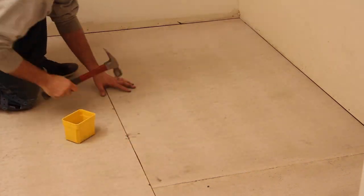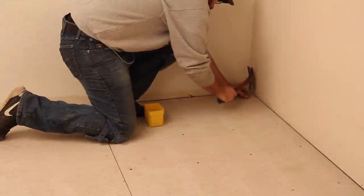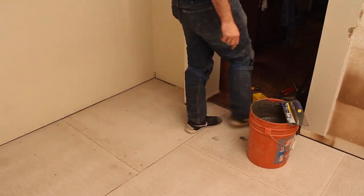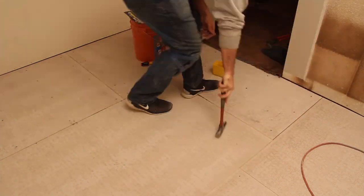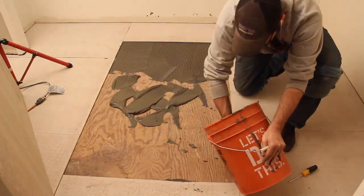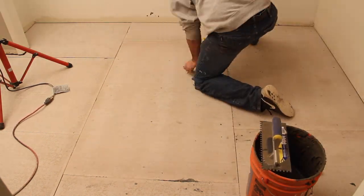To lock them in place, I used inch-and-a-quarter galvanized roofing nails and drove them in roughly every 12 inches. I continued the same process for the rest of the room — lay down some thinset, smash it down, and drive in some nails. I had to remove the far sheet first since it was notched around the other side of the closet, then put down all the nails to lock the sheets in place.